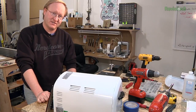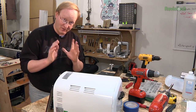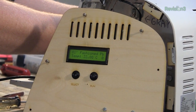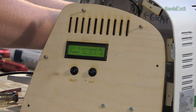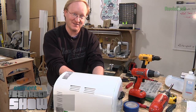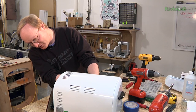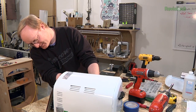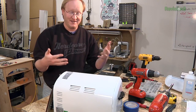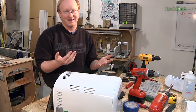I checked both the electrical connections and it wasn't the thermocouples. That made me think it was either the code or the soldering. I checked the soldering and it all looked good, so I reflashed the code just to make sure we had the most recent version. I'm going to touch both thermocouples — the problem was we hadn't flashed the code. Don't always overlook the easy, simple solution first, like 'did I flash the code?' because that's a lot easier to test than having to re-solder everything. Always look for the simple solution first. And again, that's why it's good to use headers and easy-to-disconnect items — you can easily swap things out and test. If you've soldered everything manually it might take less space but it's much harder to troubleshoot.